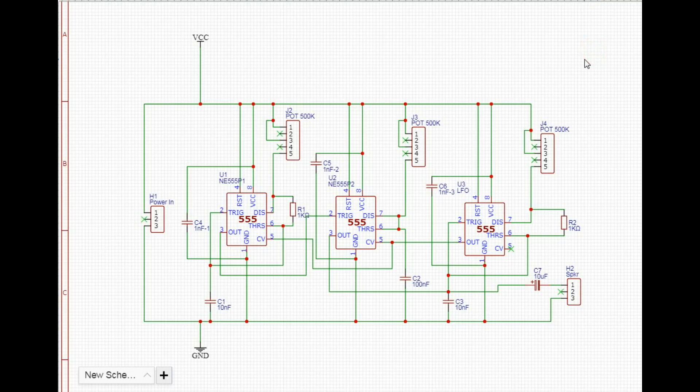So here's the schematic I drew up. It's your basic Atari Punk Console, which uses two 555 timers here — or you can use one 556 timer, I don't have any. Then I simply added another 555 timer with the output going to the control voltage pins of both of the originals. And like we found out in the first one, we do need to add some decoupling capacitors, otherwise they all want to oscillate at the same time, which is not good when you're trying to create a synthesizer sound.